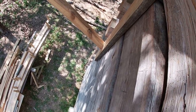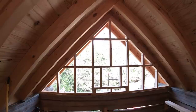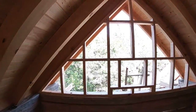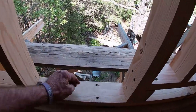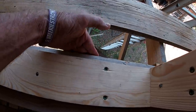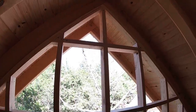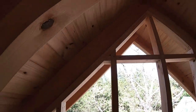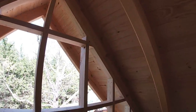I started framing the gables over D wall and it's completed as far as the framing goes. I'm using two-by-fours, framed on a 16-inch center. I held the rafters in an inch from the outside of the half log on top so the insulation board will set right down here and the siding will go down over the half log. I started at center, plumbed down, then measured either direction on the plate on top of the half log.